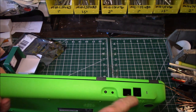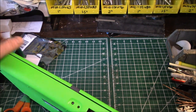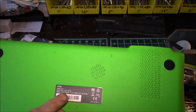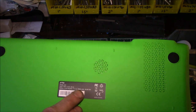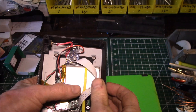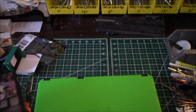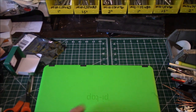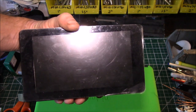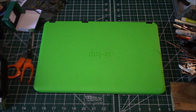The ports come right out of the back of the Raspberry Pi — you've got power, Ethernet, and two USB ports. It runs at 15 volts, 2.5 amps. It's got a 3S, 3500 milliamp hour battery, where the Pi Pad has a 1S, 2500 milliamp hour battery. So you've probably got about five times the run time — this one does about two hours, whereas the Pi-Top is eight to nine hours. This thing is a real usable system, and I'm going to turn it into my Android Auto head unit. I'll bring you back once I get a Raspberry Pi plugged in and we'll see what it looks like.